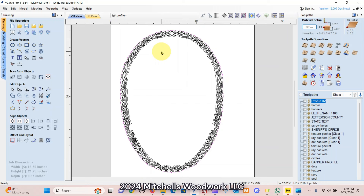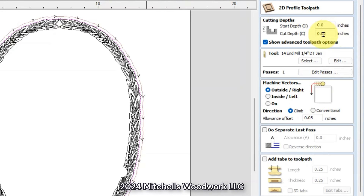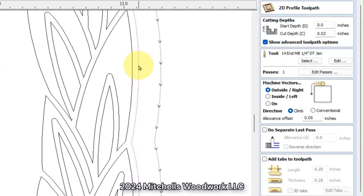I do the 0.02 so that I will know immediately if my stock is not level or not the same thickness throughout, because if it's not either one of those things, it's going to show up immediately whenever I do this first 0.02 profile. And actually you'll get to see that in the video because it did save me. So here we are, this is the profile. I'm using a quarter inch bit at 0.02 depth to the outside, and I have a 0.05 allowance offset. That gives me a little meat there that I can leave behind — so this will be the actual edge of the sign and the design will start right here. That gap is 0.05, and it just gives you a little wiggle room. It also looks nice.